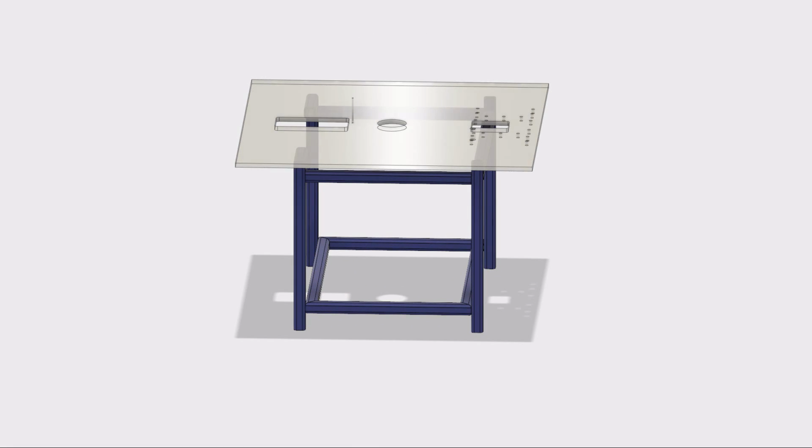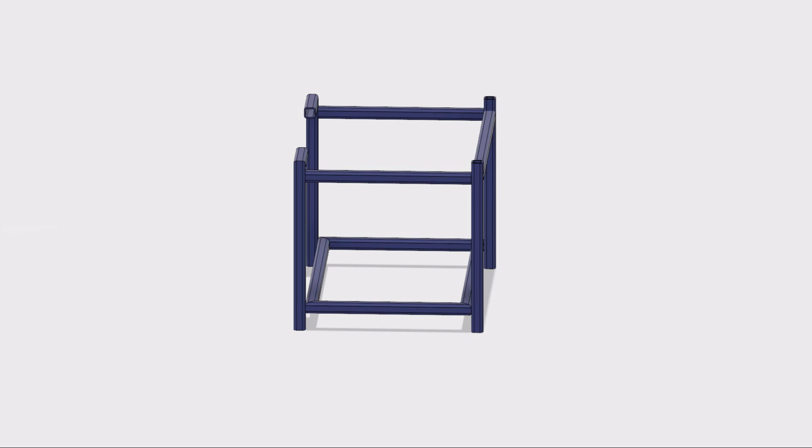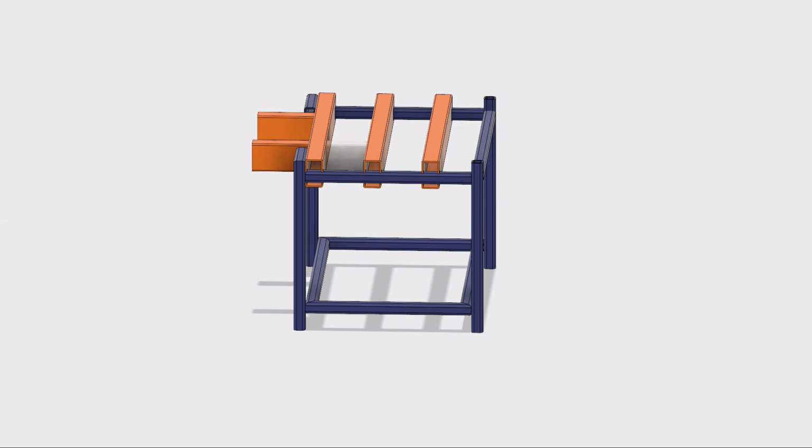The base plate is completely unsupported across most of its length. The solution? I'm going to reinforce it with these 3 cross members, which don't actually touch the plate, but support these 6 smaller pieces of steel that can be flattened on the mill and then welded into place to ensure a nice flat surface for the plate to rest on.